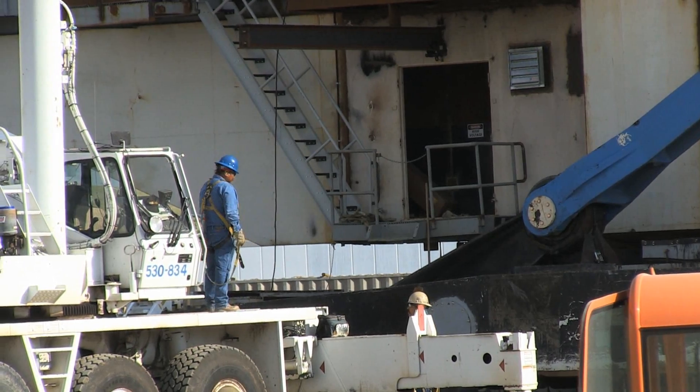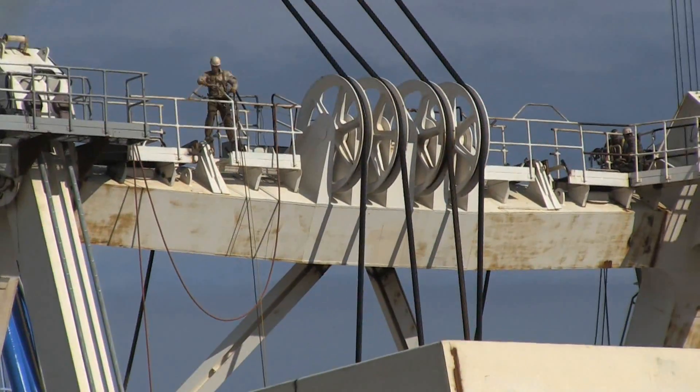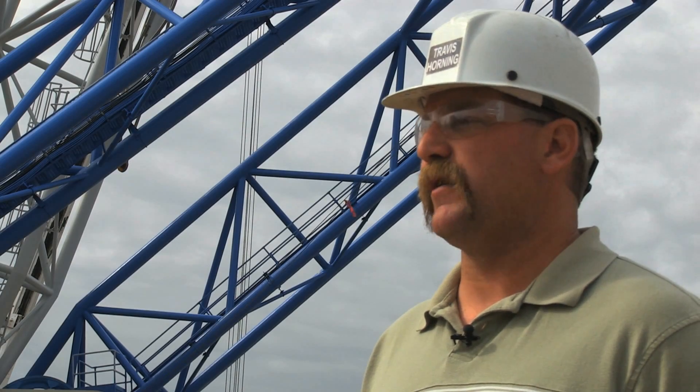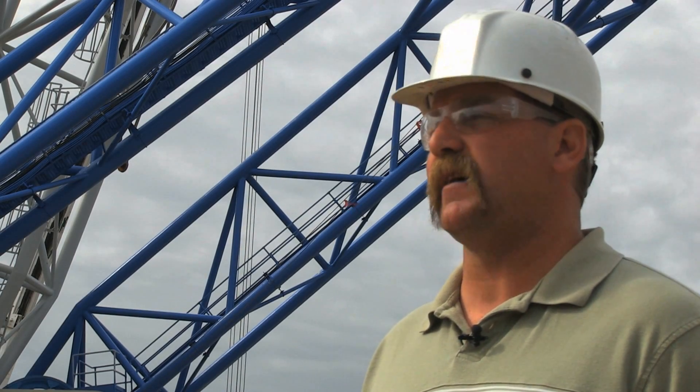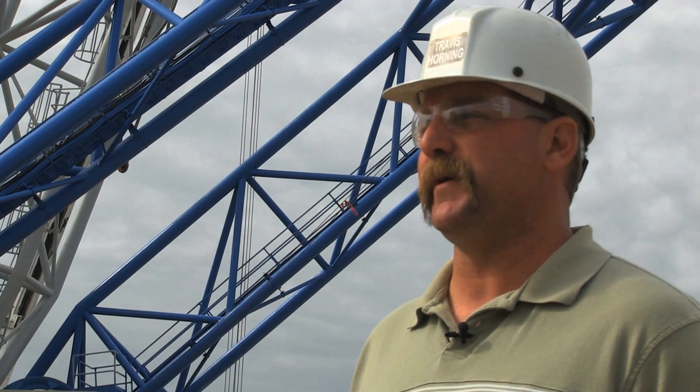So it's electricity? Yep, it's electricity. Throughout the lift, ground fault monitoring is de-energized, meaning other draglines in service are turned off to avoid an electrical trip. It's grounded, but it's not picking up any loss of stray voltage going to ground. We can pick up milliamps, and we don't want to pick up any of that.